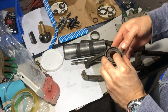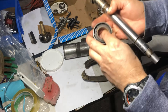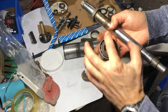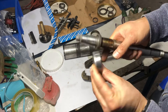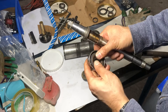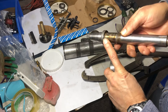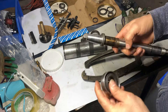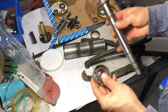This bearing was originally this way, so if I pull it up you can see it would just go right out. What I did was take the outer casing and turn it around, installing it the other way. I had to install each bearing ball individually. This was the only way I could do it, because this part of the shaft was not going to allow me to grab the center. I don't know if there are special machines for that, but I couldn't do it with the tools I have.